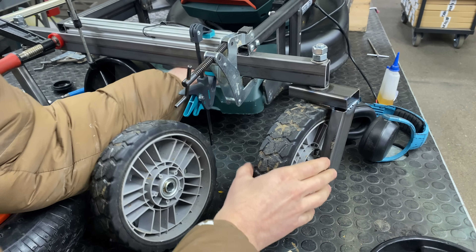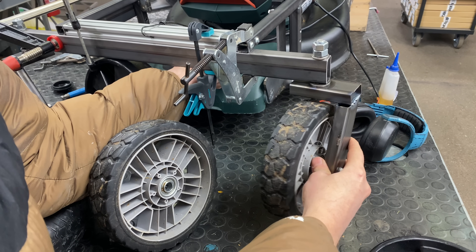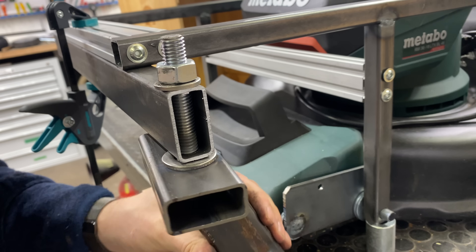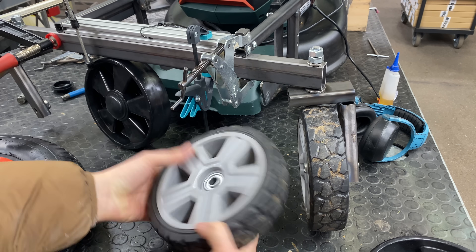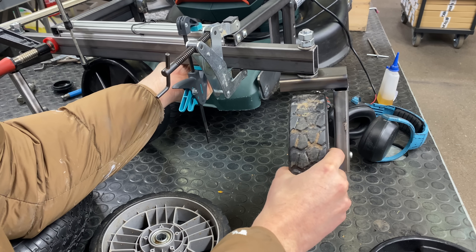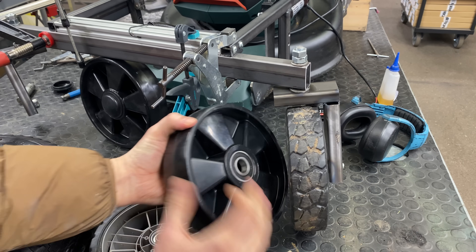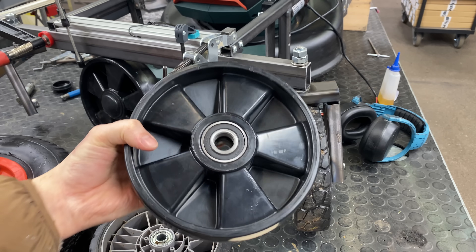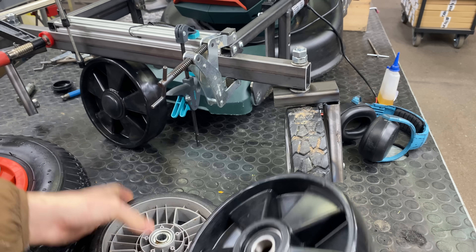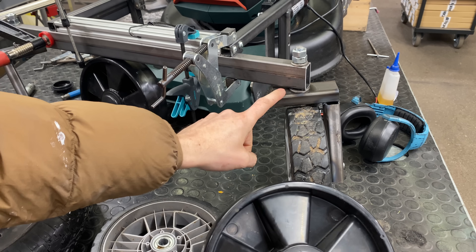Unfortunately these wheels don't work properly. One thing is this motion — it's too loose and that makes it bind instead of swivel. The other thing is that these wheels themselves are pretty loose on the screw; if I tighten the screw anymore it wiggles even more. It doesn't work. Luckily I've got these wheels left over — these are from a forklift and they have really big bearings in comparison. So I'm going to use these and rebuild this completely.